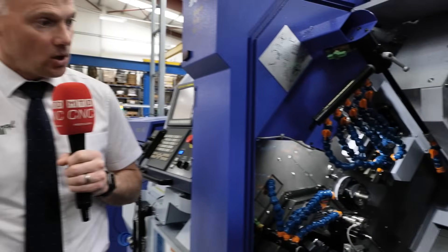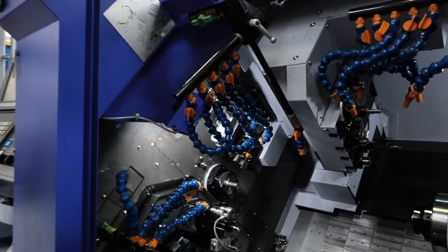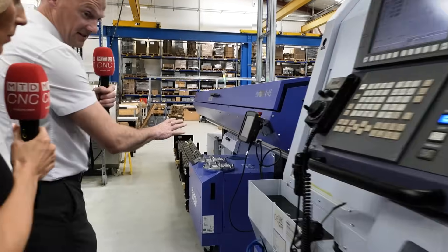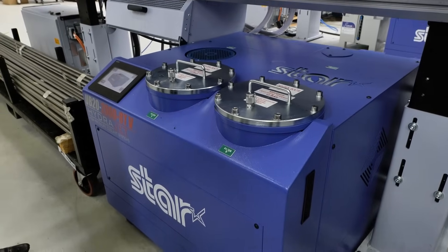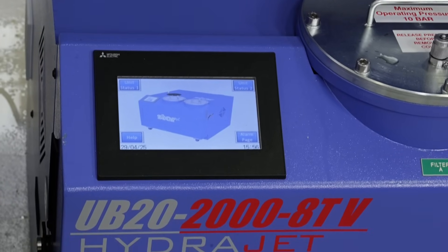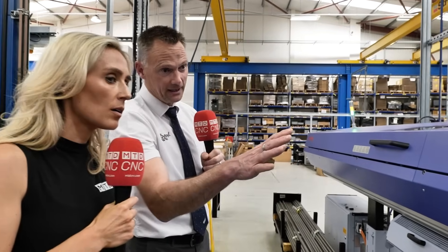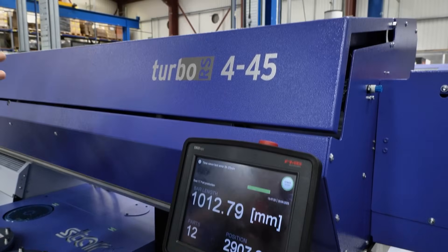This is a brand new machine for this style, so what you see here is unique to it — the layout, the turret, the platen with the B-axis, and so many different options you can put on the turret. We've also got later-generation high-pressure coolant pumps, which they haven't had on previous machines. This one is a twin filter. One key feature is a variable drive motor — rather than just going on or off, it ramps up to whatever's actually required, which is better for power consumption and oil control in the machine.